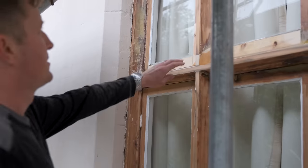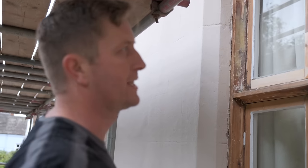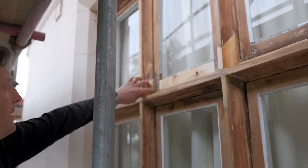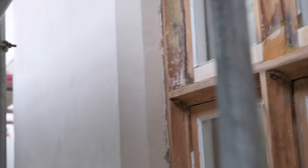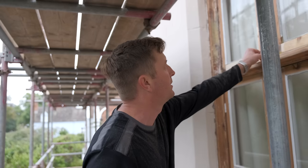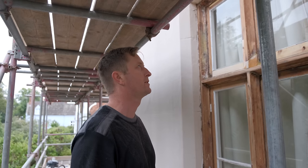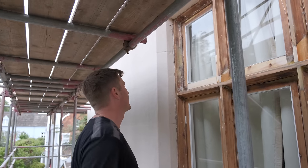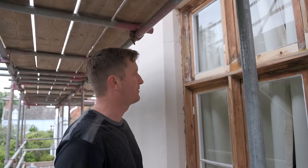So that's most of the big stuff done. To get in the corners I need the smaller sander. Some of the smaller areas I have to get in with a multi-tool and chisel — you never get all of it out, and it will have to be smoothed off with a finishing filler afterwards. But it does its job — that is so strong now, it really has done a good job on this. Just a few areas up top to sand that I did yesterday, and we're good — ready for decoration. Then I'll have a coat of paint so you can see any more discrepancies and basically fill again.